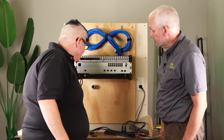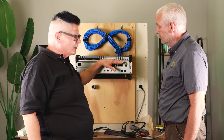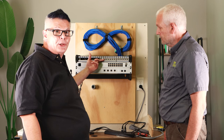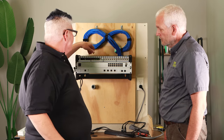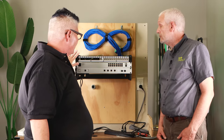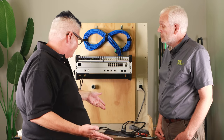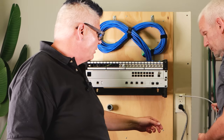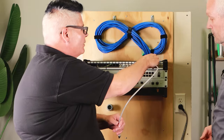So what you have here is a multimedia AV panel accepting shielded runs, a couple of multimedia keystones — which are not shielded — and spots for some unshielded runs as well. As long as your patch panel is bonded to ground, all of this is going to work great. All you have to do is take a patch cord and start plugging your stuff up — let's get a shielded patch cord and plug it into a shielded keystone.